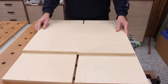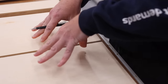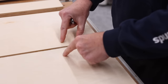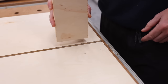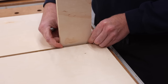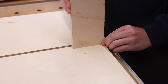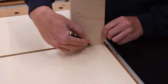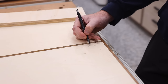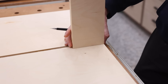The same thing applies to the top and bottom — I want them to match the look of the sides. Looking at the two cabinet sides with the backs facing inward, I need to make sure the grooves are in the back of the panel. We're also going to have nailers in the back to give my screws something to go through and drill into the studs. I need the groove to start flush with the end, and sized for the quarter-inch or 6mm plywood back panel, so it fits right behind and is perfectly flush with the back of the cabinet.